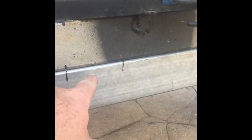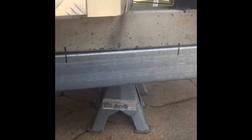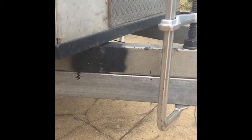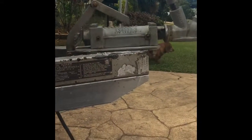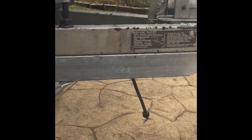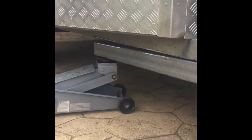You can see the markings I've done so I know where to grind and have some clear patches of steel to weld on. I'll take that off, grind up the paint and a bit of gall off, and we'll start welding. I've got the whole two sections cleaned up where I'm going to weld them together - no paint or gall. I'll clamp the front and anchor that with some welds, then use my jack as I move my way back. You can see that huge gap, so I probably caught this just in time.